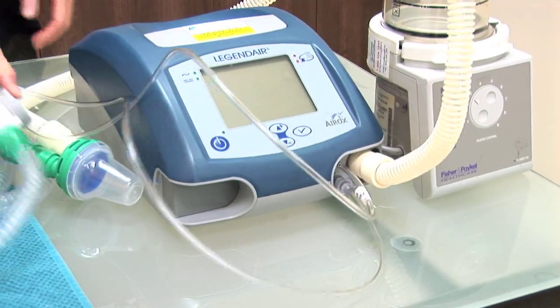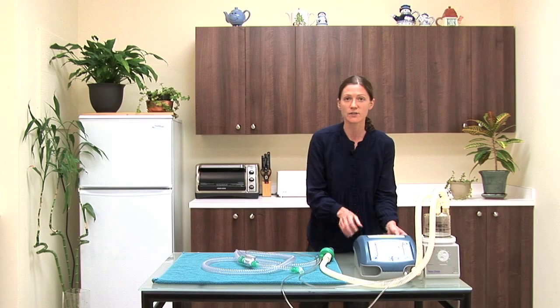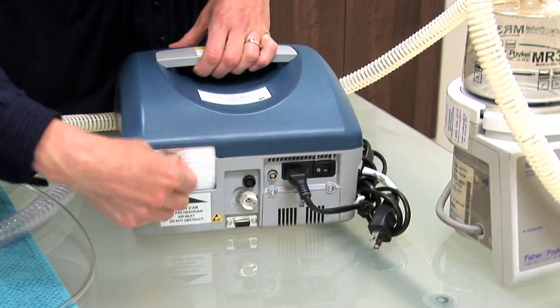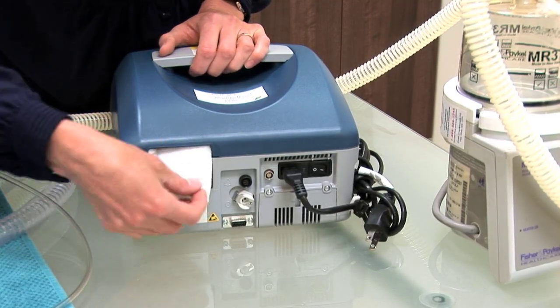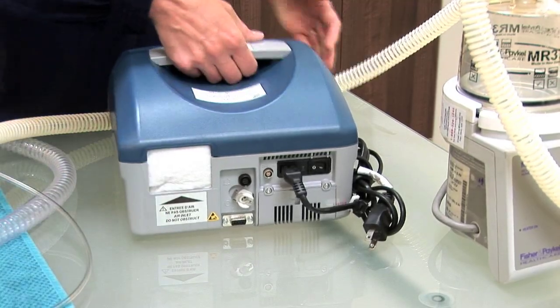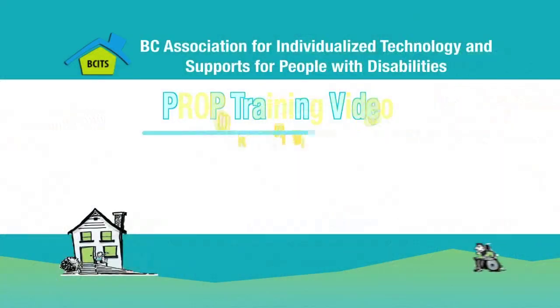The last thing we recommend is to look at the back of your ventilator at the filter. Check it regularly — about every two weeks. When it starts to get a little dust buildup, remove that filter and throw it out. The filter just comes out like that — this kit is disposable. Get a new one and put it in with the white side out, and you're ready to go.